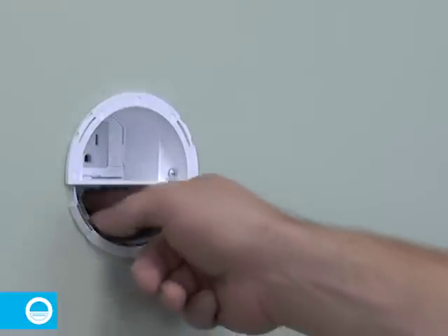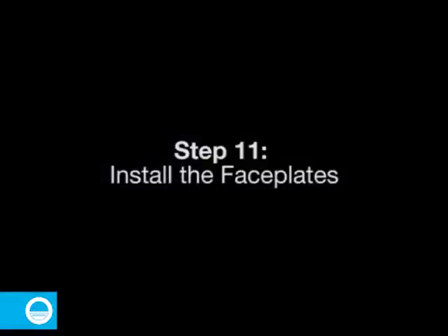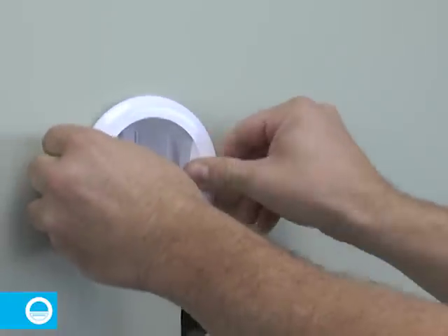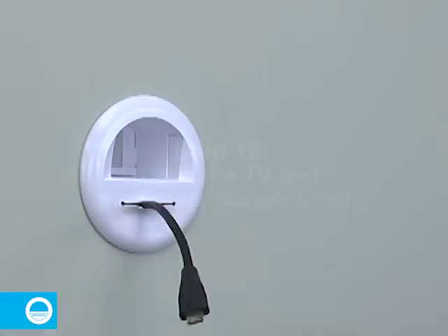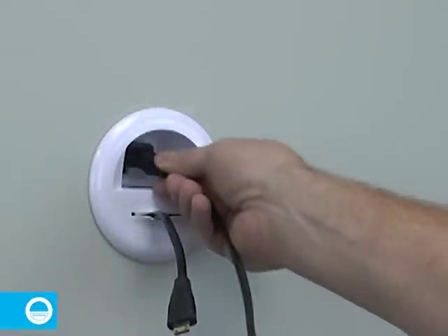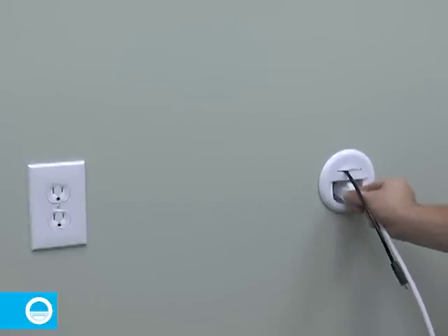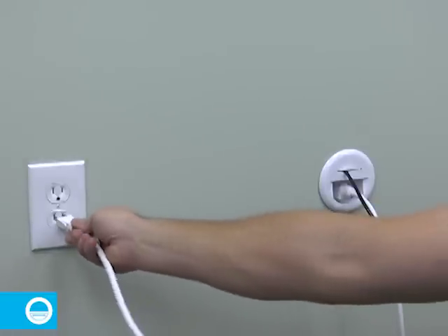Push the cables into the low voltage box and continue feeding until they are protruding from both the top box and the bottom box. Pull the low voltage cables through the rubber membrane in the faceplate and snap the faceplate to the box set — make sure all four snaps engage. Plug the TV power cord into the receptacle. Plug the power supply cord to the inlet and the nearby receptacle. Connect the low voltage cables to the TV and to the home theater equipment. You're all done!